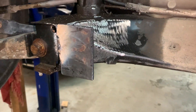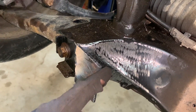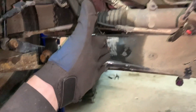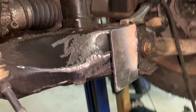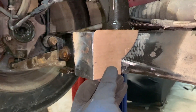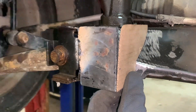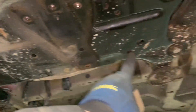A couple of plates welded in, just tacked for now, but hopefully now you can sort of envision what I'm getting at. What I'm going to do now is make a piece of plate go from here across to here — that way you can see that I have a really nice flat spot to weld my pipe to. I also went ahead and did this side. I made this template and I can't believe I actually did that on my first try — not like my first TV try, but like actually. That's kind of cool. I'm making all this out of 3/16th plate. It's going to be the bulk of what this cradle is because I'm going to be cutting out a pile of it, so I want it to be strong.